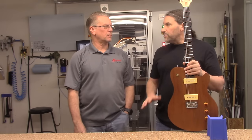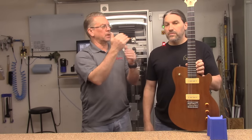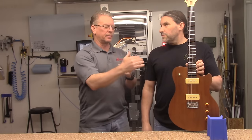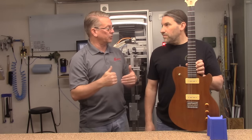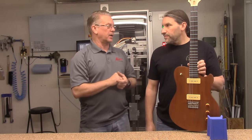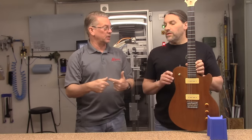How long does it take generally to do? To go through an entire, let's say it was just a guitar, we're going to scan it, evaluate it, and come up with a proposal of what to do to make the playability better. All the way through to implementing the process, and then the final sanding, flap sanding, is still done by hand, other tweaks and adjustments are still done by hand. It can be about a 2-hour process start to finish. Okay. Once we get into more of a production schedule, then it'll become more efficient.